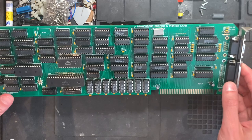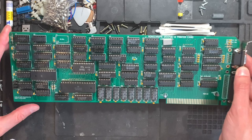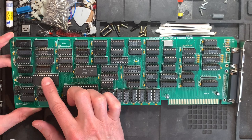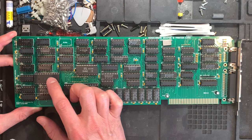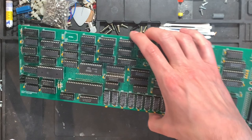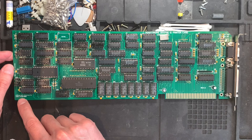And that's that. Again, this is a very, very neat design. In theory it supports up to 256 kilobit EEPROMs. However, if you use the 256 one, then you need to write the ROM in a particular manner. So I suggest, I've got, I think, a 64 kilobit. Yeah, this is a 64 kilobit EEPROM. If you can get your hands on that, take that. It even supports the 2301 and 2732 ROMs, but those are even more rare, but would be period correct.